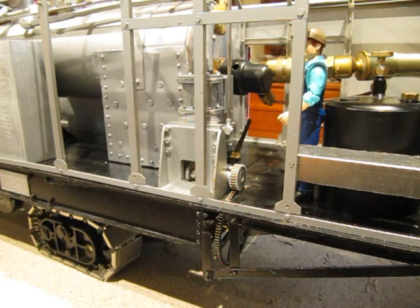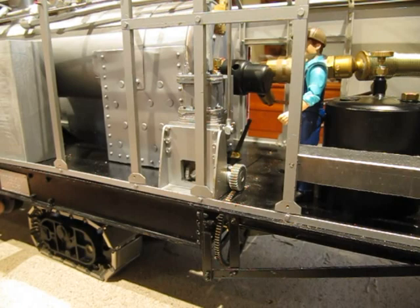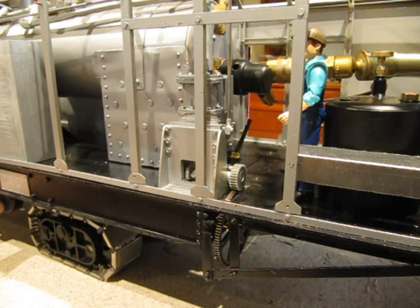The steering engine behind the boiler drives a gear train from the crankshaft down to a larger gear, which runs on a shaft that goes up to a worm gearbox that drives a screw across the front of the tracks to turn them side to side.